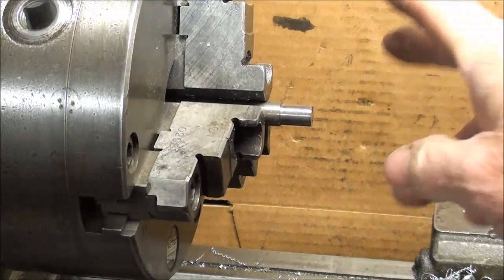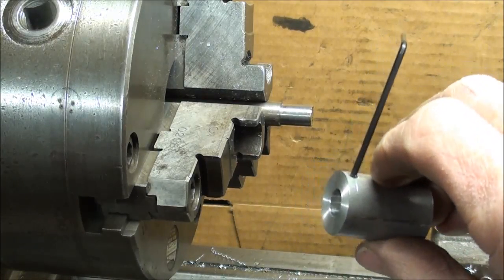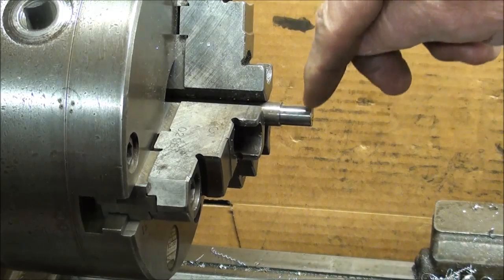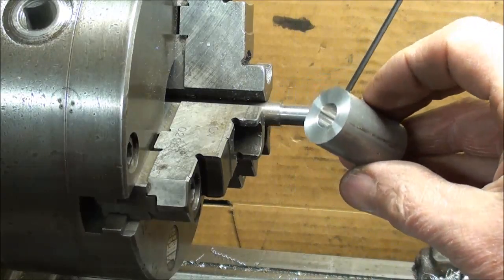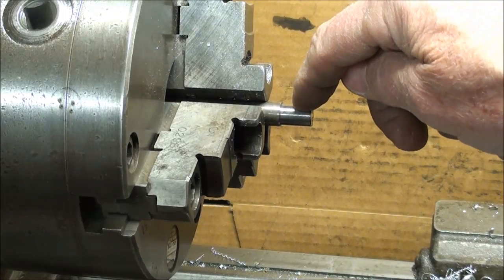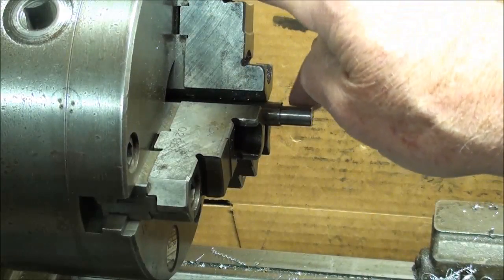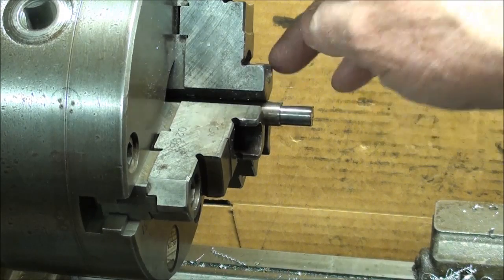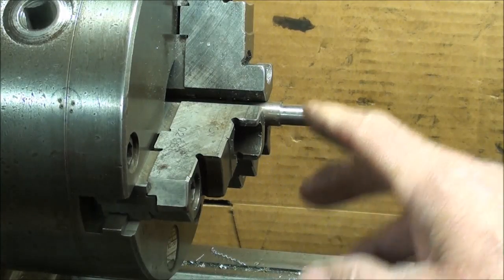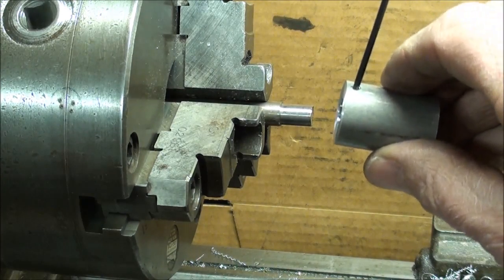Now, this is the most important thing I'm going to tell you for the whole project: we're going to turn this on a mandrel — a homemade mandrel. This is half-inch stock that I've turned down to exactly three-eighths, of sufficient length to go into the hole. I've turned that down and left it in the lathe — it is perfectly concentric with the spindle of the machine. It doesn't matter how far off your three-jaw chuck is. If you've got a collet attachment on your machine and it's very accurate, just a piece of three-eighths stock will be sufficient. I like to turn the mandrel and leave it in the chuck until the job is done, and I file just a little flat spot on there for the set screw so the work won't spin.